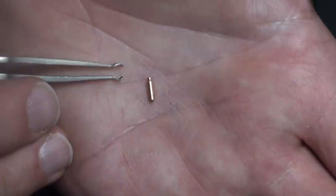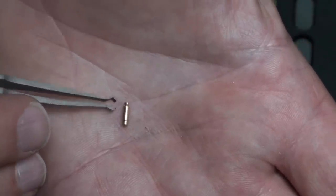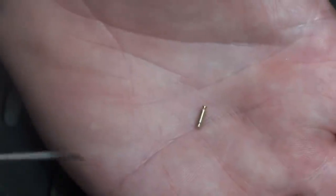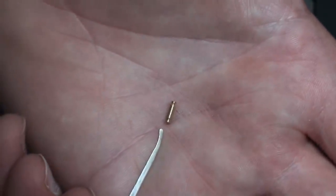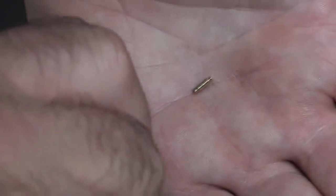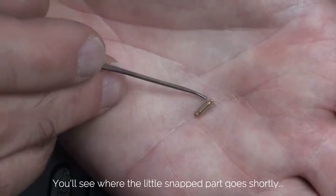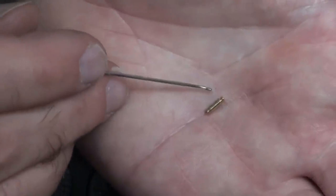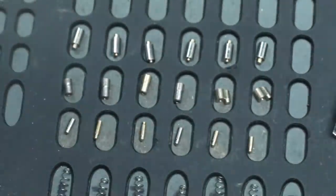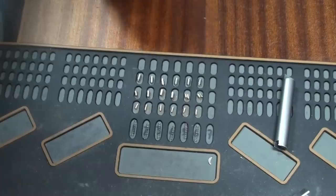If I hold chamber three's inner pin up to the camera, you can see this is the construction-keying pin. It has a snap-off element — there's a little waist on that pin at the top. When using the construction key, it operates at the shear line there. When you put a real colored key in for the first time, it pushes this pin a little further than the construction key would, you snap it, and that shortens the key pin by a millimeter or so. The construction key no longer works, but your five standard keys will. Very cool and very simple.